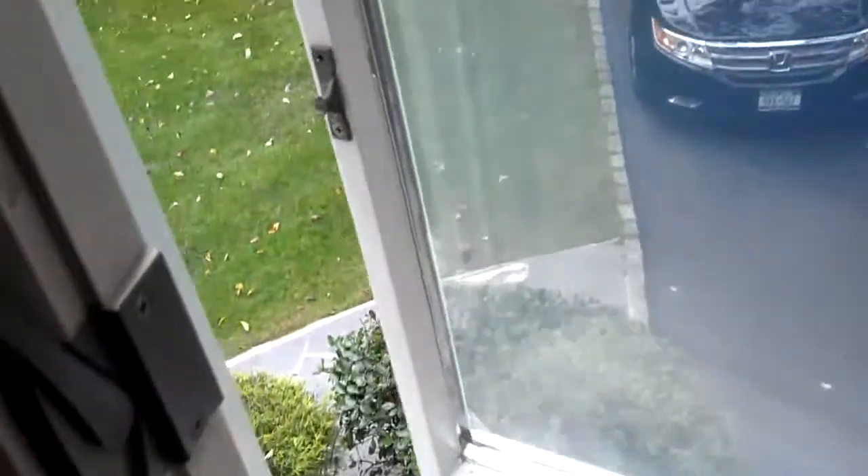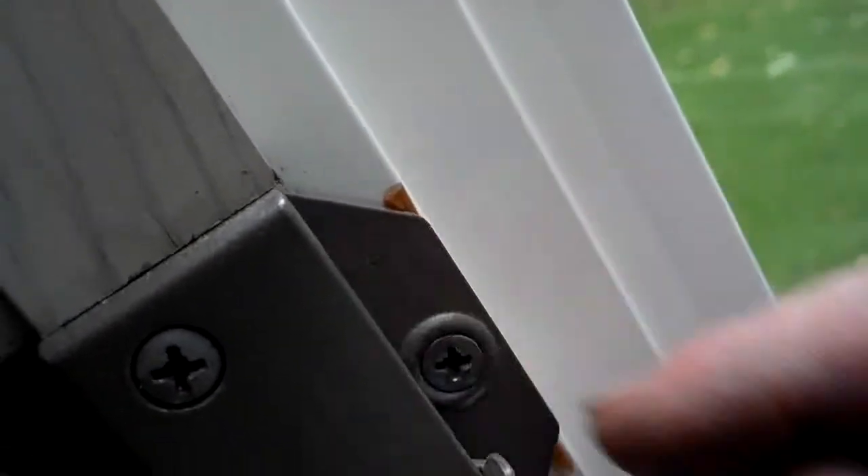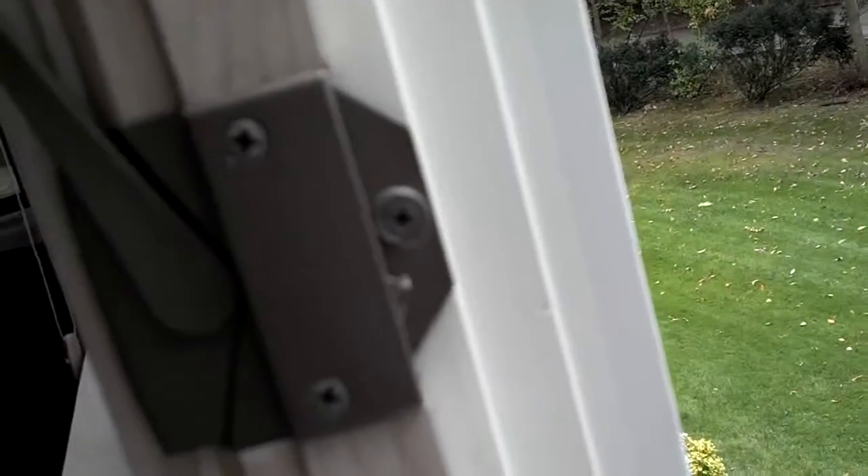The window is now in, so we're going to crank it closed. At this point I discovered I had put that bottom locking lug a little too far to one side — you can see it's not really centered compared to the other one. The simple fix was to shim the locking mechanism with a one-eighth-inch dowel — basically a toothpick — shimming the lock out a little bit. Problem solved. I trimmed the dowel off so no one notices it. Not everything works out the first time, but I show you how to handle problems as they come up.